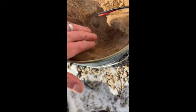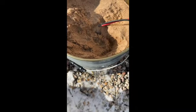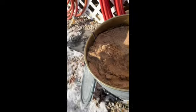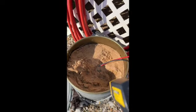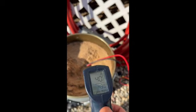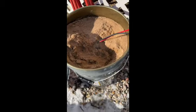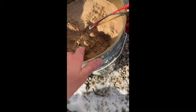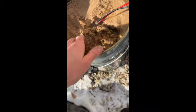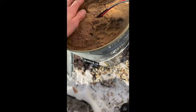Woo, there's steam. Okay, a little too much. And this is moist right now, so my sand isn't completely dry. It performs better when it's drier, they say. So we are 35, right near the element. It's 42, and you can see the steam, I think. So that 18 to 20 wasn't steaming off, but once I dug that down, it started to steam up real good. Now let's turn this up a bit.